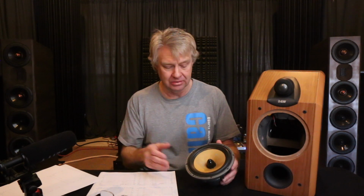You know, I design a lot of drivers for companies, and I design our own drivers, and I'll give one of our manufacturers a list of specifications that I need met. I choose the materials and things that I want used from it, and sometimes we'll base it on something we've already done. I'll say, let's take this, and we're going to change it and add that. We're going to make a higher Q version for open baffle or something. And then I get a sample from them. And then I measure and test that sample, and I say, great, this is perfect.